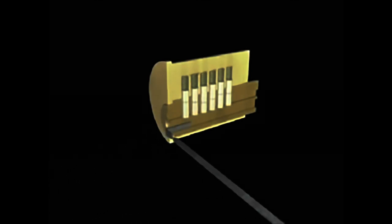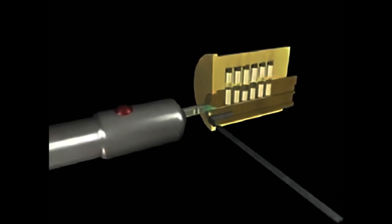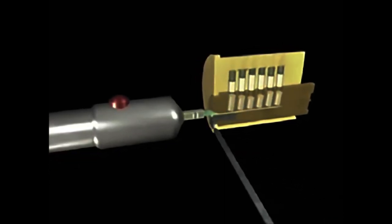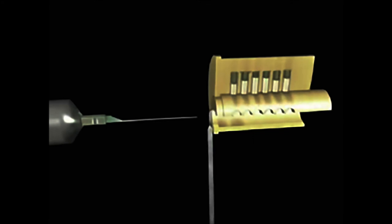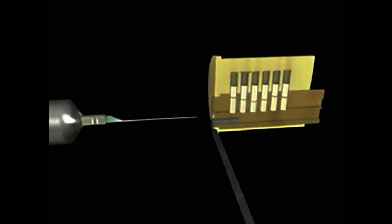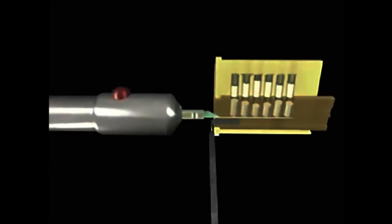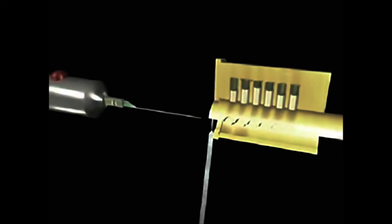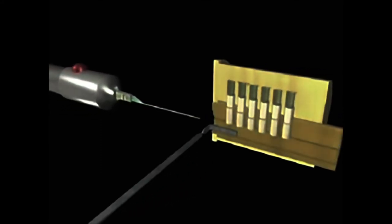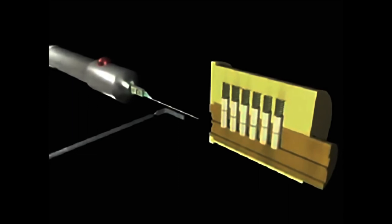You really don't have to know all of this theory to effectively use a vibration or impact tool. Just put it in the keyway, pull the trigger, and rotate your torque wrench at just the right time. You must be sure to make contact with each of the pins. When using an impact tool, make certain that you impact the center of each of the pins exactly straight on and at the same time — the blade must be exactly parallel to the keyway. Some tools have angled blades to allow holding the tool at an angle if space is tight. These will require a bit more practice to ensure that the blade is always parallel and strikes all pins simultaneously. Different locks will require a different amount of force for their pins to bounce properly. The locks must also be in good working order — if the lock is dirty, the pins may be unable to bounce freely inside their chambers.